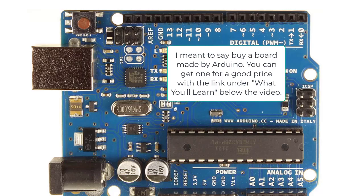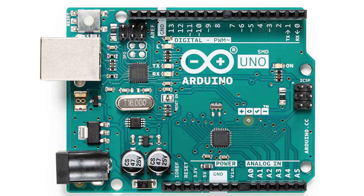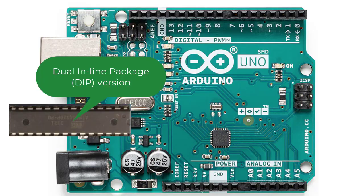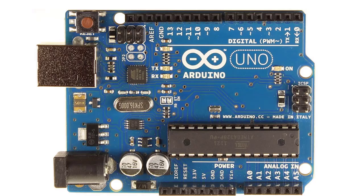There are two different types of Arduino Uno boards. There's the one you see here, and there is a surface mount board. They're almost the same thing except the little CPU, which we could see, is actually a surface mount chip instead of a dual inline package or DIP. This is an SMD board, and this one is the regular DIP or dual inline package board.